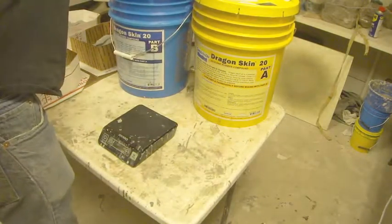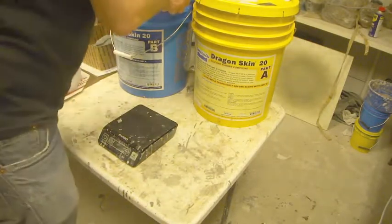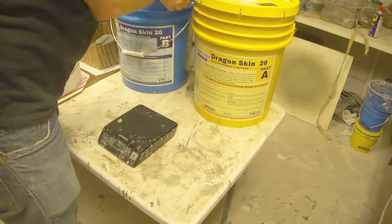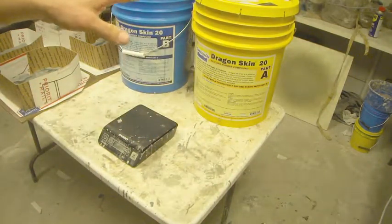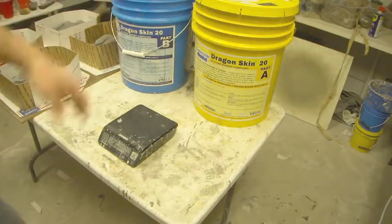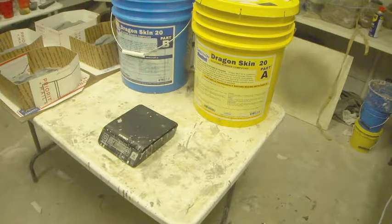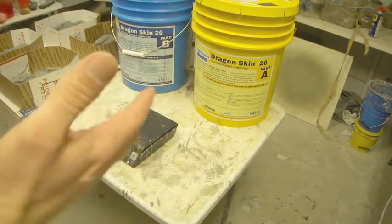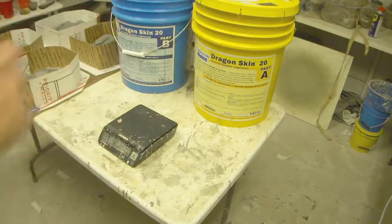The other reason that people tint their silicone for molds is so that when they mix the silicone together, they can tell if it's mixed thoroughly, because Dragon Skin is a clear silicone. Now this half has been tinted into a very pale flesh tone, because that's what we're using to actually run these hands and whatnot. So it technically isn't necessary here, but for the interest of having them be different from each other to create pairs of molds, I'm going to tint it anyway.